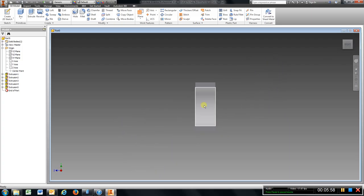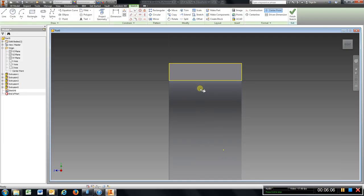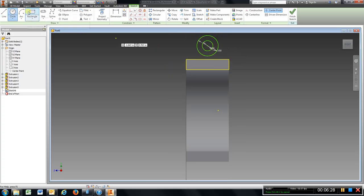I am going to turn to the front, put a sketch here — it shows a radius of a quarter circle. I am going to find the center, go up, type in .5, enter. My small circle is .25 diameter, enter. It tells me that from center to center is 3, so from the center here to there it has got to be 1.5. Draw a line from there down to here.